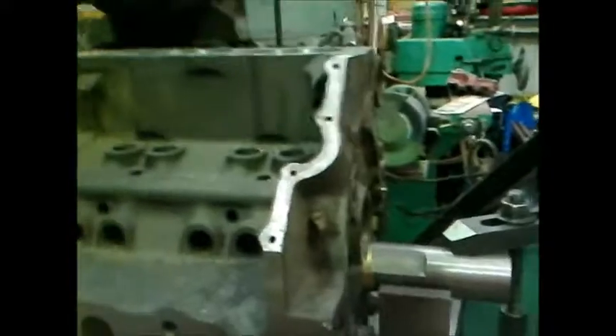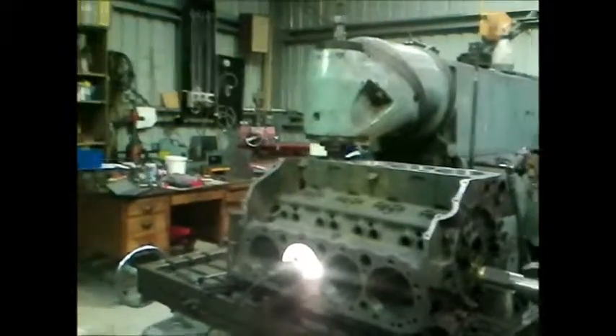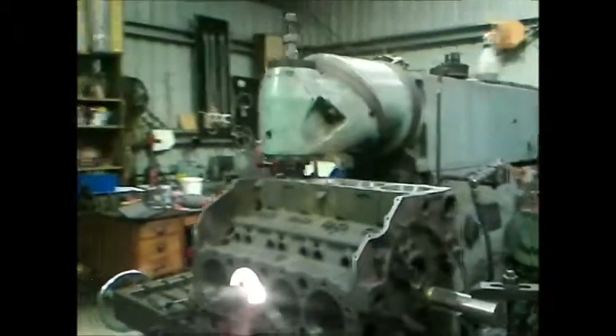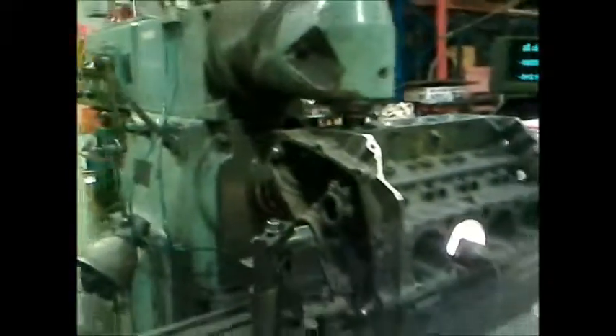The other thing I do with this setup: when I've milled the sides, I'll change the cutter and mill the deck. Then I'll leave the table at the same height, roll the block over on the bar in the V block — so the bar's sitting at the same height — and mill the other side at the same knee height. Both decks will end up not only square with the tunnel, but the same height off the tunnel. So when you put your engine together and check your piston protrusion or piston heights in the four corners, they're within a thou or two. It's a simple setup that works very well. It's a little bit more time consuming boring cylinders in a milling machine like this than in a production boring machine, but I far prefer this — I'd rather put a bit more time into the job. So yeah, that's cylinder boring.